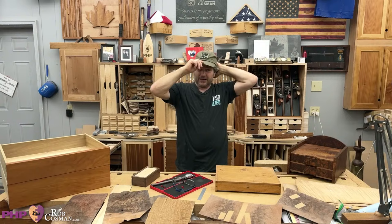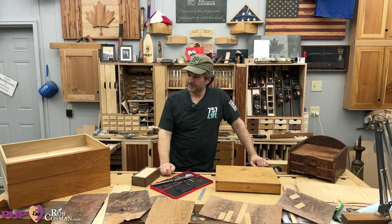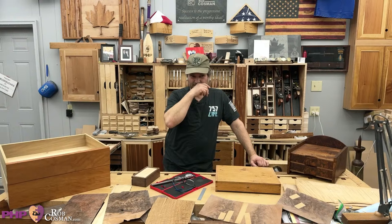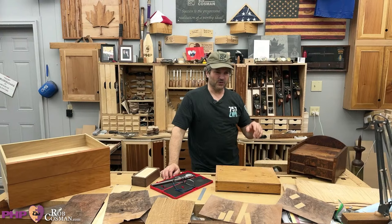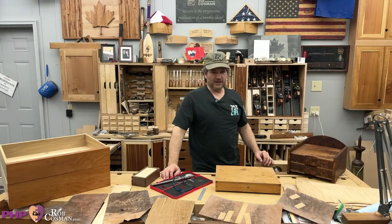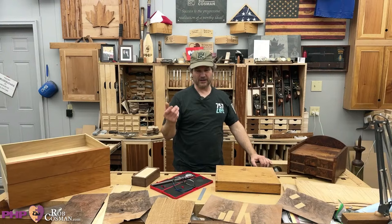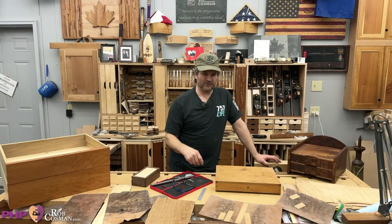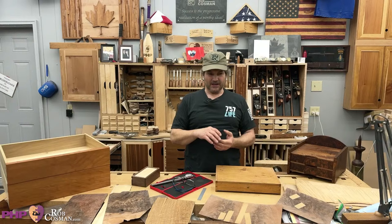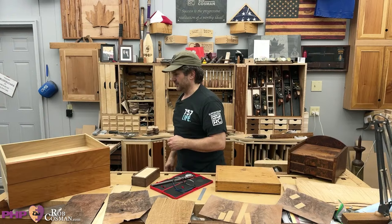Just some heavy polyethylene and a hot melt glue gun to seal it. Problem is it doesn't last very long — 6 mil is the thickest you can get locally at hardware stores and it doesn't take long before it gets holes. I'd just take my glue gun around and fix the holes. I used an old compressor off a refrigerator with a hose on the intake — you have to keep it running but it would draw enough vacuum. If you don't have that, then the expense of multiple sheets of MDF — if you had a very large surface you'd need quite a few sheets.